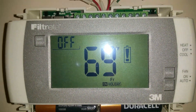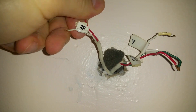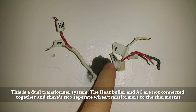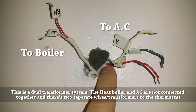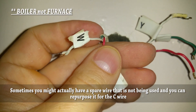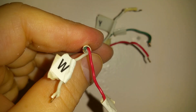Looking at the wall, I can see two sets of wires - one for heating and one for cooling. That's because I have baseboard heat: one system handles the baseboard heat and a separate system handles the AC. Looking closely at the bundle, I actually see three wires and you can see a green in there. I'm going to go to the furnace - that green wire should be there unused - and use it as a C wire.